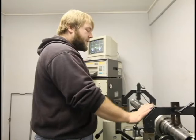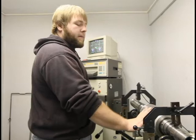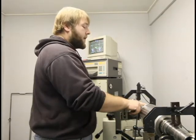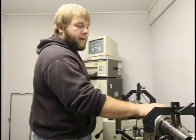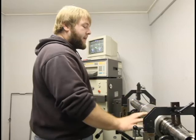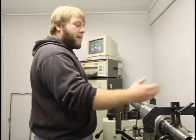The reason for balancing these shafts like this is because it will give you a better balance in fully assembled spindles. By doing it this way, if you picture yourself on the highway in your car with the tires vibrating at high speed, this is basically the same thing — it's a higher speed spindle and we're balancing it like this.